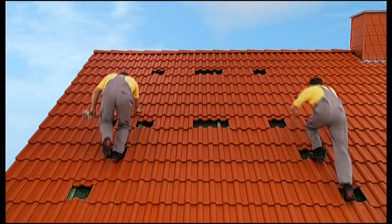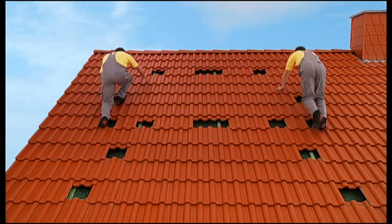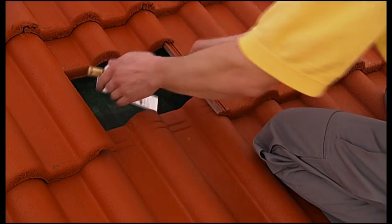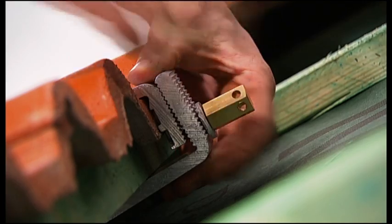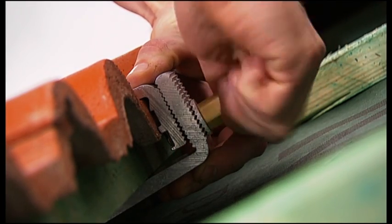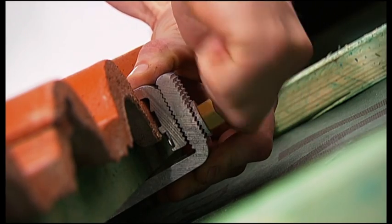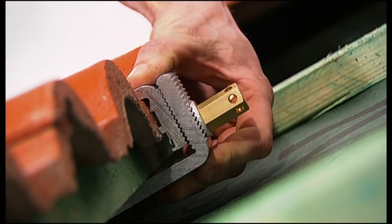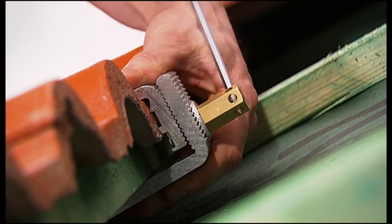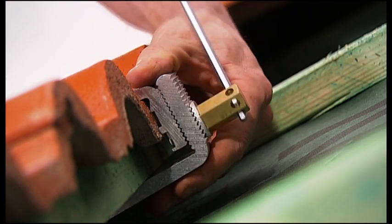Finally, fit the one-sided collector clamps to the right-hand edges of the DIN rails. With everything properly prepared, you can get going. You'll be done in no time. For starters, the roof hooks are hung on a roof lath. Slide the lower segment upwards until it touches the lath. Now, fasten the nut. While tightening the nut, make sure the serrated washer is properly positioned. And that's it — no more mounting required.